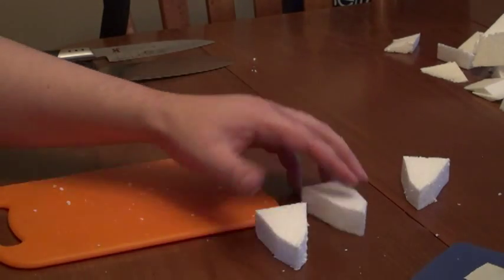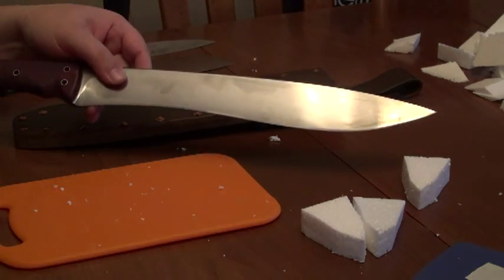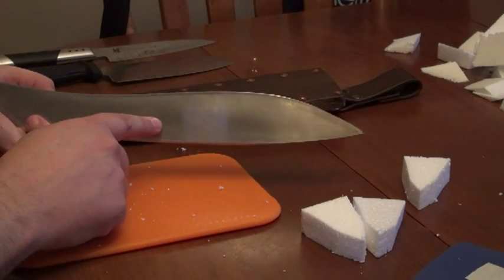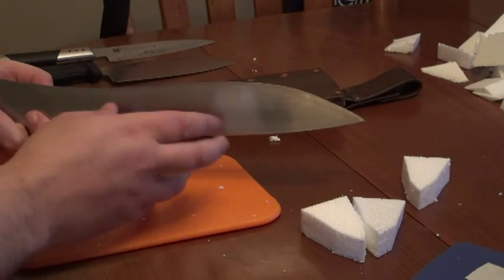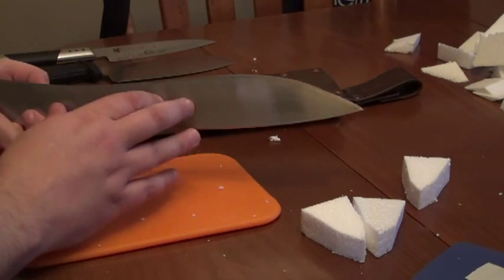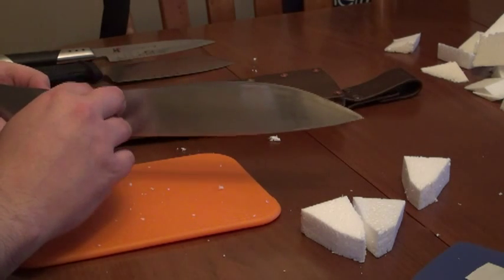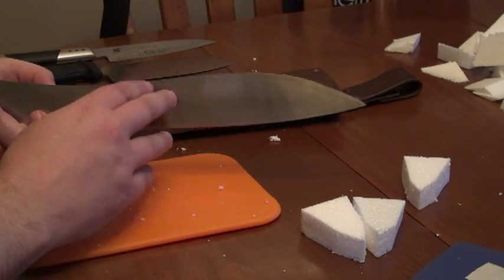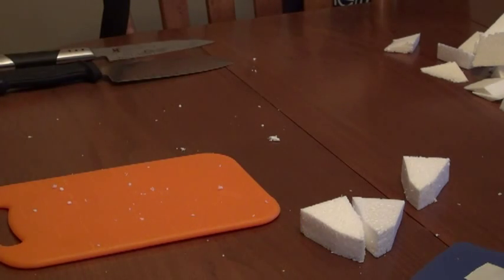However, I wanted to maximize the cutting ability-to-durability ratio a bit more. After doing a lot of work with larger knives of relatively high quality — here's an example, this is an Excalibur by Gavco — what I had started doing was taking the primary grinds of these knives, bringing them down as close to the edge as I possibly could until the edge failed, and using that to determine the maximum cutting ability. What I found, though, was that in general that isn't the great way for durability to be optimized. Instead, it's much better to have a transition bevel between the primary grind and the edge grind, and that transition bevel provides a more optimal cutting ability-to-durability ratio. I've talked about that more in the chopping blades content — about the limit of where you start one grind, where you go to the other, and the angles I normally use. I've found that same concept holds over even to smaller knives.